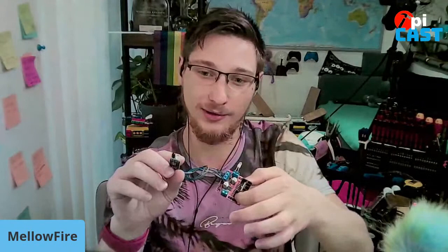You've also worked on a soap dispenser? Yeah, I still use that — I'm working on version two now. I'm using an IR proximity sensor instead, which is a lot faster. I'm waiting on some logic converters to finish it off, then I'll print a new holder. I've got a Pico in there now which is way overpowered for what it does, so hopefully this will minimize the whole internal structure and make it cheaper.